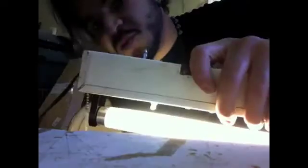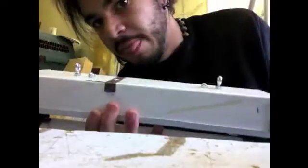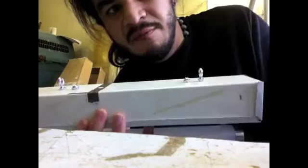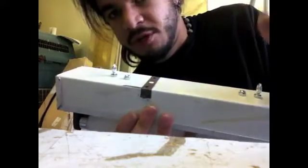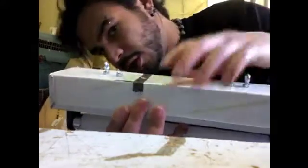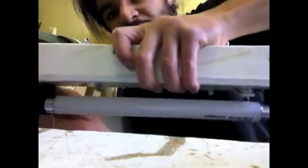I get a good amount of blinkage with these properly rated chokes. It's not the most blink-happy thing in the world, but given the lamp size it works. So if you ever want to make a fixture for one of these lamps and you want to make it preheat, you've got to test a number of different preheat chokes — both some 1420s and some F8T5s, and some for 9-watt CFLs. You want to look for either a 1420 choke that underdrives lamps significantly but will work perfectly on this one, or an F8T5 choke or a 9-watt CFL choke that overdrives lamps. Both of those will be in the right ballpark for this.